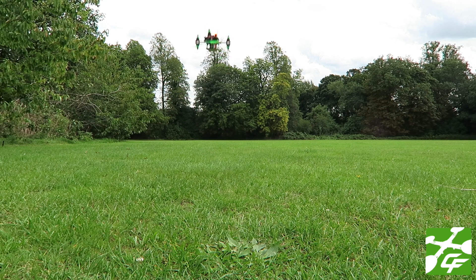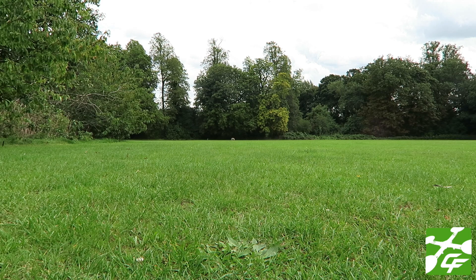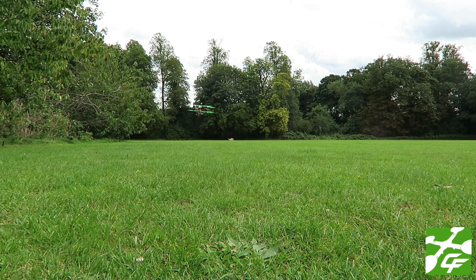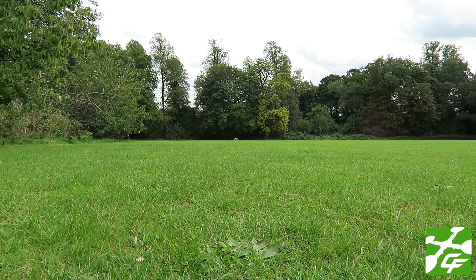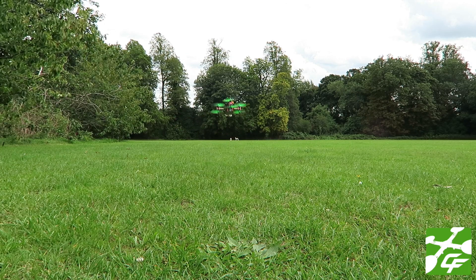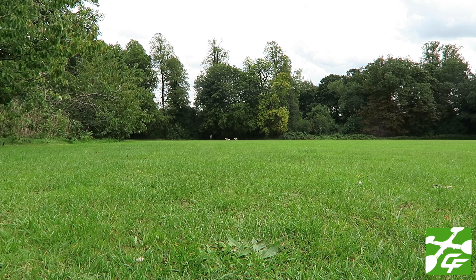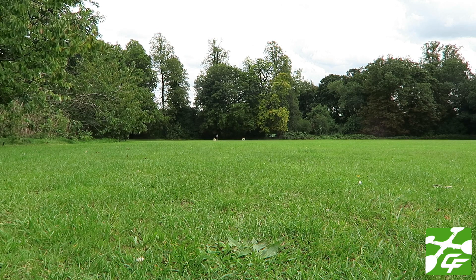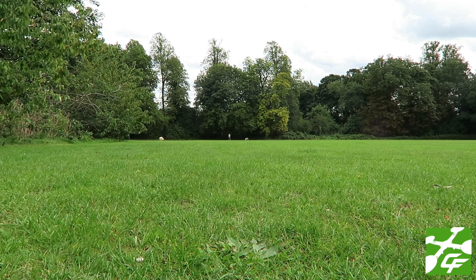Thanks to Andy at GAA Tech, who I use for my prototyping. The TriBot in its current configuration has an all-up weight of just 420 grams. The T6 has an incredible power-to-weight ratio, producing a whopping 5 kilos of thrust with the 1806 2300KV motor setup.